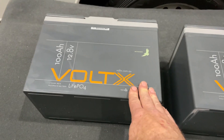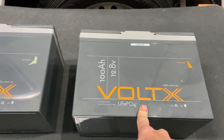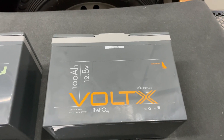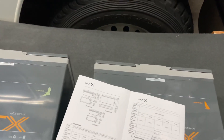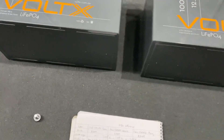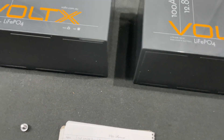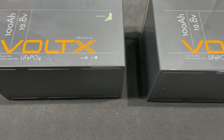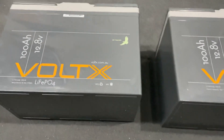Cutoff voltage for the basic is listed as 10 volts, though the website spec sheet says 11.5 or 11.2 volts depending where you look, and the information sheet doesn't match either. The BMS spec actually states about 10.2 volts. The label on the back says 10 volts, so we'll run with that and see where we end up when we do the load test.